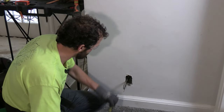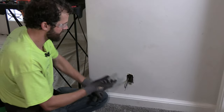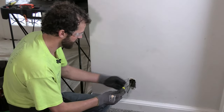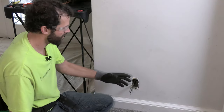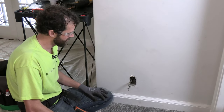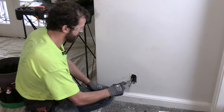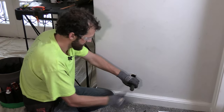I'm going to poke around with a flat head screwdriver before I cut. I'll dull my metal drill bits really fast on the plaster, so I like the feel of a manual tool without the distractions of power and vibration. I'm trying to figure out where my framing is — it's really hard to use a stud finder reliably through three-quarter inch plaster with metal lath. I can see my cable coming in top left. Let's keep probing the wall.